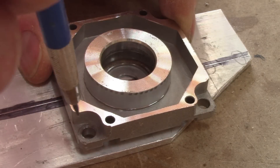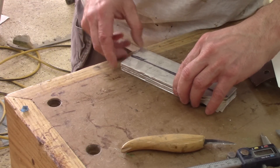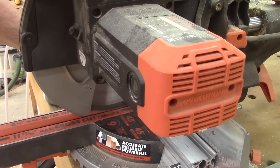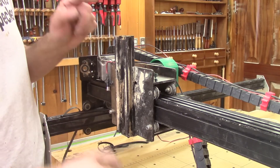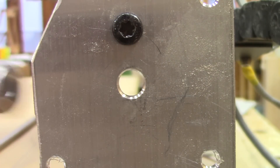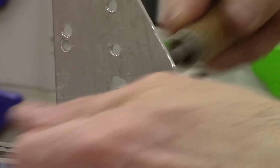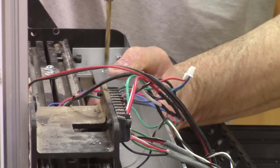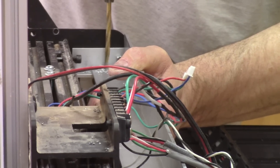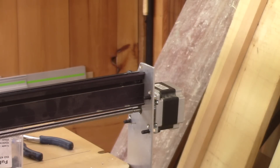I begin by cutting some aluminum. Using the original support, I mark where I need to drill the holes in my new supports. I stick them together with double-sided tape and drill all the holes in one shot. Then I can cut the Z-axis rail that I bought, which is longer than the original, and put it in place. I noticed that I drilled the holes for the Y motor too low — and it's only later on that I noticed they were not even low enough. I also add a new back support to hold the wire chain, because with the new water hoses it's becoming too heavy. I also made a support for the X-axis driving nut.